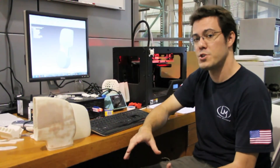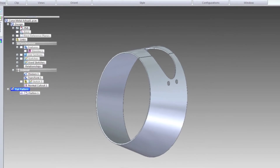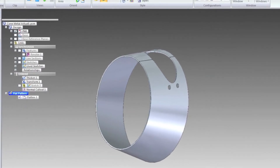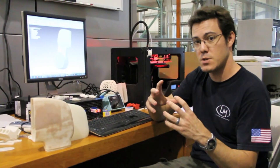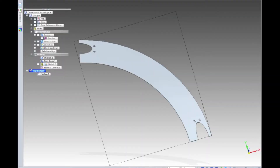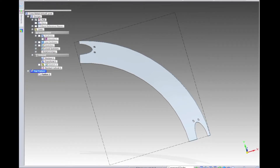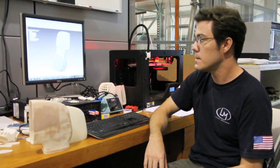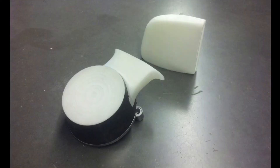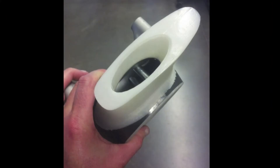From there we took the model and split it up into three chunks. We did the cone piece that goes around the Big Sucker — we actually made that as one flat sheet of sheet metal. We unrolled the 3D part into a flat sheet that got cut out on the water jet, then put that through a roller to get the curvature right again, and welded it up. The other two pieces — basically the top and bottom half of the actual scoop and the neck itself — we 3D printed, and they came out great.